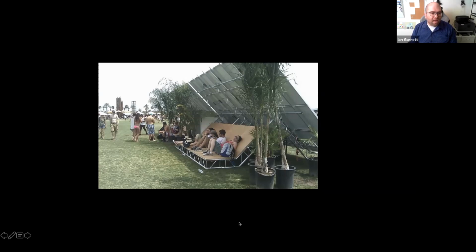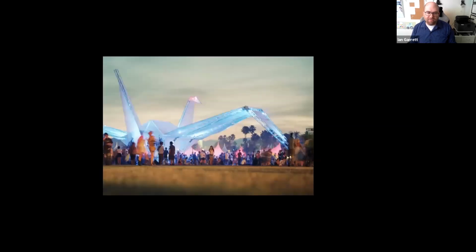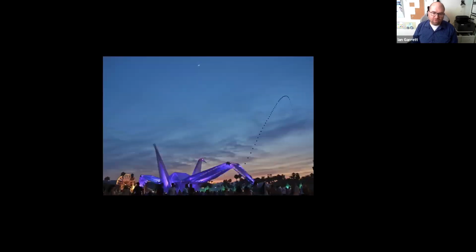And if you want to know where the batteries are, there's sort of a white box in between the seating here, and that's where all the batteries are. There's a channel with all the power sort of dug in across. So it becomes a second opportunity to provide shade as well. We sacrificed a little bit of efficiency. So as the sun goes down, the power flow to the batteries is reversed. We turn off the solar and turn on the battery so it flows through to the lights themselves. So they're coming up as we get to dusk, and we've energized those. We had estimated a power ceiling about 6,000 watts, 6 kilowatts, and planned for the system to actually completely drain the batteries.